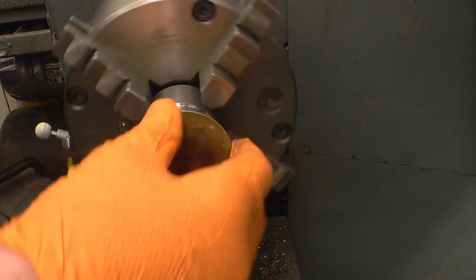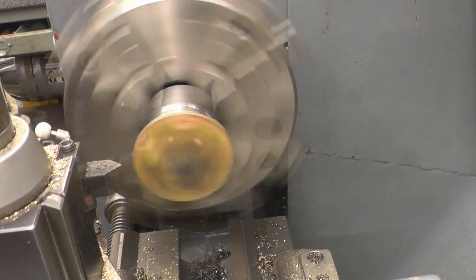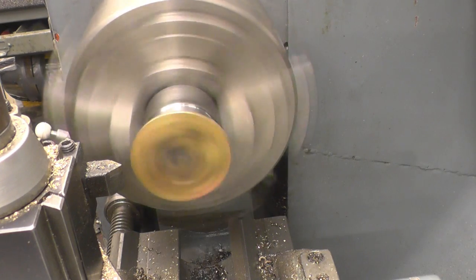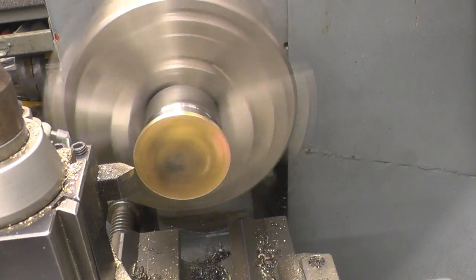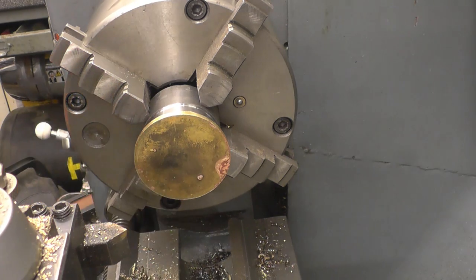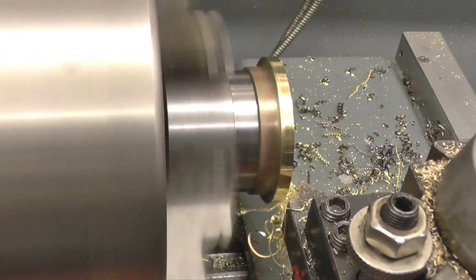The mandrel's running through. I didn't quite have that centre properly, but I can't help myself — I have a little bit of machining to do. You need to tell me what diameter I make it, as that's how much feel I have on there — it's just sort of the look, that's all. This is nice brass — you can see the way it's machining, it's not going off in horrible shards, it's machining more like a bronze.